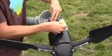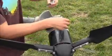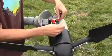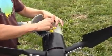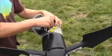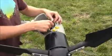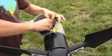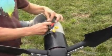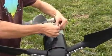You'll also see our stator wires, which have the yellow nuts. Depending on what voltage system you want, you need to rewire your yellow and red wires. To make things easier, we're just going to go ahead and unscrew our red and yellow wire nuts — just remember that the red wire nuts go with the brush wires and the yellow wire nuts go with the stator wires.